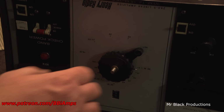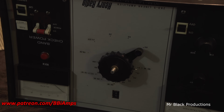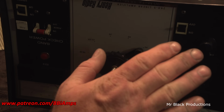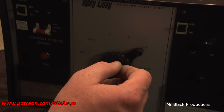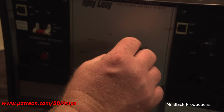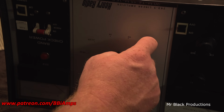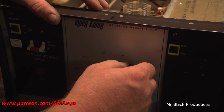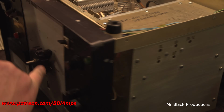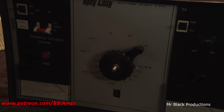Well, I did a creative workaround where I took a 6-32 stainless steel piece of hardware with a 3/8 inch long shaft and took it over and sanded it down till it was paper smooth on the back. And then I took the 6-32 thread nut with the retaining clips on it, the star washer built in, took it over and sanded that down till it was only about a thread thick and put it on here. And that way we can maintain our clearance from the faceplate and the arm. See that? And still impart the amount of torque that we need. And looking at it from the side, you'd never even be able to tell it's been modified. That's what we're looking for.